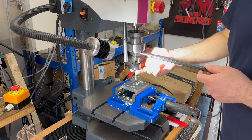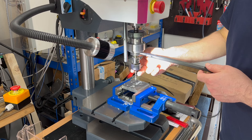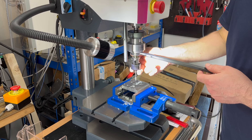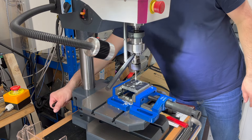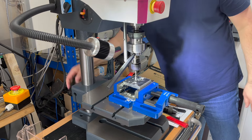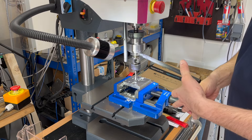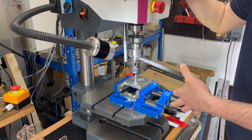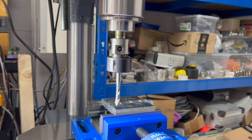For the video I simply went back and re-entered the existing threads that I had already cut, multiple times, just so that I could show the whole thing from different perspectives for you. And interestingly, it always found exactly the existing thread track, so that I afterwards only had one thread track. That means I did not cut multiple overlapping threads — instead the adapter always found the existing thread, so that I could cleanly finish cutting the threads.